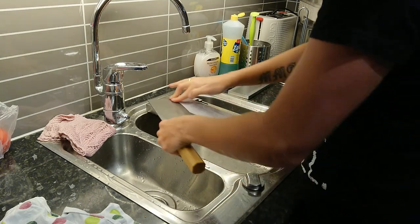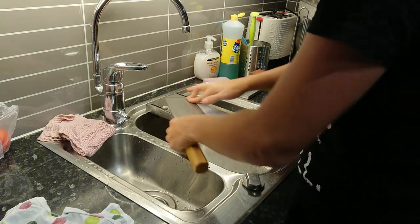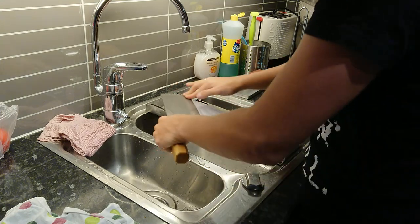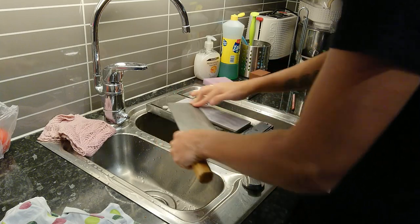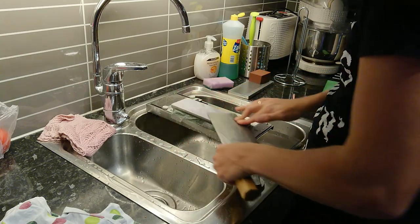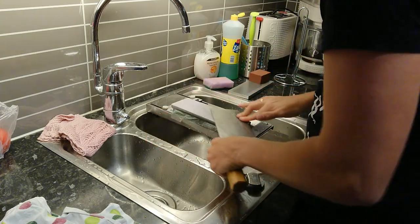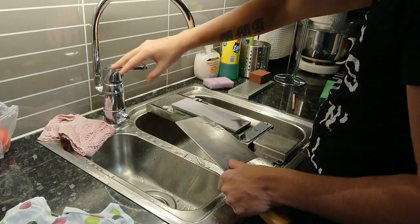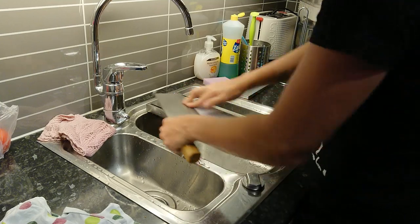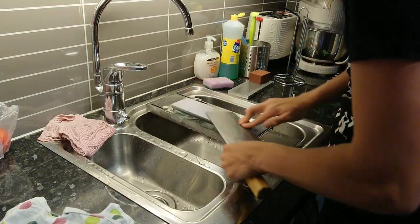I'm not using a lot of force, I'm using 2-3 kilos, 4 to 6 pounds of force, just to match up the hollow ground with the edge, and then making it a bit more convex afterwards. And as I said, this feels incredibly good on the stones. Just crisp and so nicely heat treated.